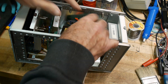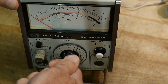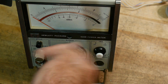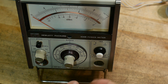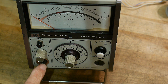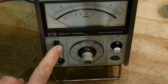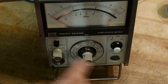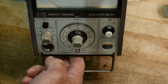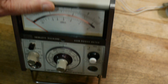Now that I can confidently say I can put it in this box, I can concentrate on what to do with these knobs on the front — collector current and base current, or base current and collector voltage — and figure out what to do. I need to put some switches on it too. I took out the end connector on the front, so I might have a switch here — like NPN/PNP — put that in this hole. There's also a hole down here where the sensor used to go; I don't need that any longer, so I can put a switch there. There's a zero button here I could replace with a toggle switch. There's probably room for four more switches if I need them — here, here, here, and here.